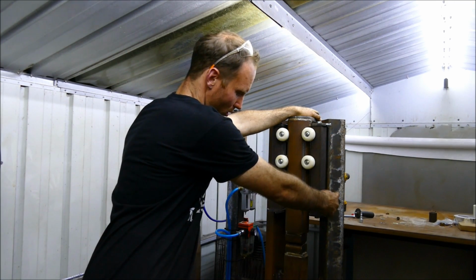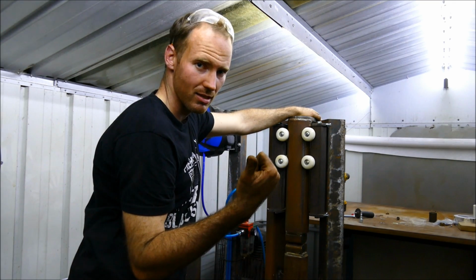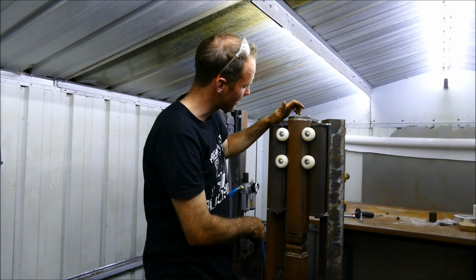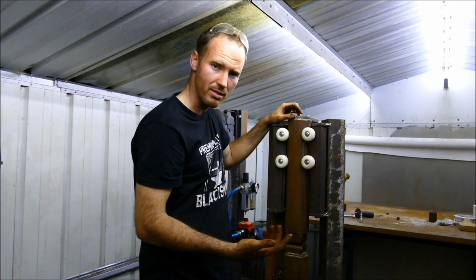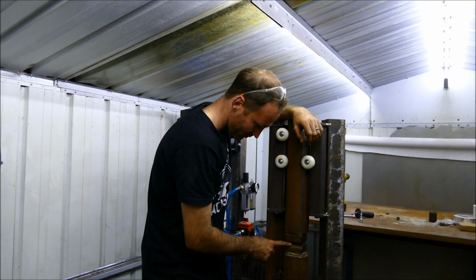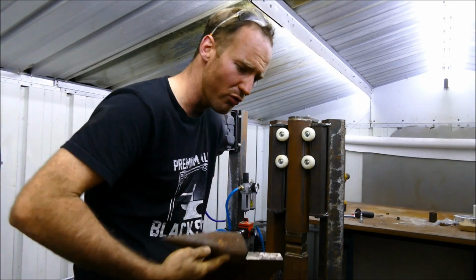The 80mm tube box section and the 50mm box section, those are excess stock from what I had left after building the staircase, that floating staircase, another video. All the other parts, like the laser cuts that you see, the top one is actually the only one that I had bespoke made from an engineering shop next door to me. They've got a CNC plasma table. The other parts, believe it or not, were reclaimed off another machine. The hammer dies are railway track. Here we go, that's what's left in the little piece of railway track. You might recognise that from the barbecue forge build video.